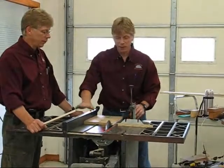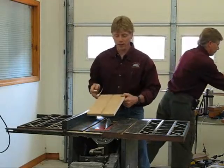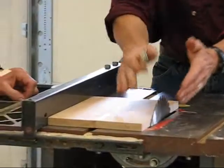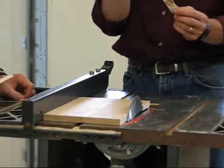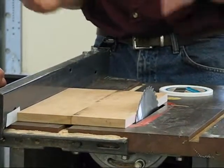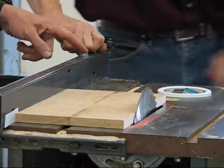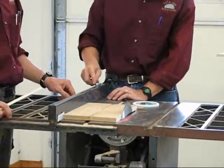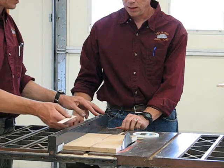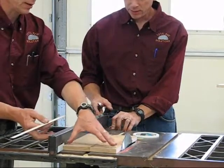Now the next step is lining up your fence. By doing that, I already pre-cut a board — it's squared up and parallel. You're going to take this board and stick it right along your fence, and along right against your blade. Now this right here is a lid from a sour cream container. You take a little shim out of it and place it right at the end of the board. This is roughly a 12 to 14 inch board. Loosen up the fence and slide it right up to the wood. You've got to loosen up the bolts on the fence so that it can move back and forth. This will hold the true perpendicular wherever it locks down — that's where it's going to copy that same pattern with the saw blade. We're loosening it up so it can float back and forth, using the parallel board as a gauge.